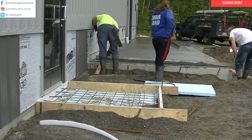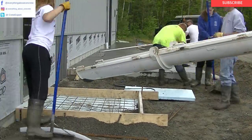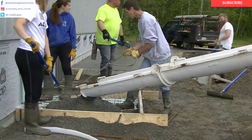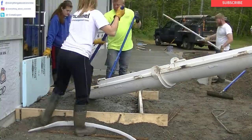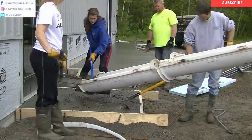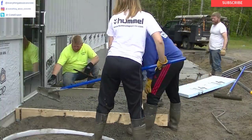There's that little entryway. We drilled and pinned that — it's the main door into this building, and we wanted to guarantee that slab never lifted. If it did lift even a half to three-quarters of an inch, you wouldn't be able to open that door. That's why we drilled and pinned that little section and put the styrofoam under it. We also put styrofoam up so we wouldn't splatter against the door. And we're putting rebar in the edges just to help strengthen them up a little bit.